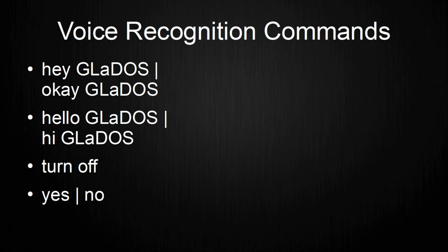I have also implemented a command to exit the activated voice recognition. This was done because sometimes the voice recognition still interprets the activation commands into anything I speak. The next two commands are for controlling the Raspberry Pi, where the command shutdown shuts down the Pi and the command reboot restarts the Pi.